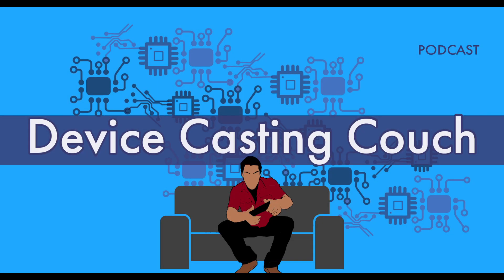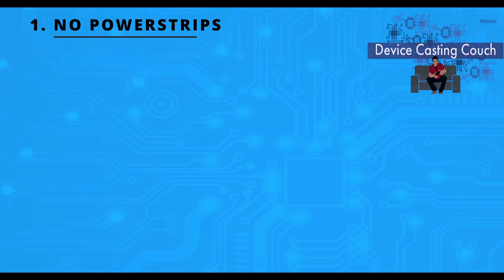Lastly, if you do set one of these up, I have some closing tips. One: don't use a UPS or any kind of power strip with these. You can try it and see if it works for you, but just keep in mind they're not meant to be used with anything except going straight into the outlet. A lot of that equipment will degrade the signal or block it altogether, so keep that in mind.